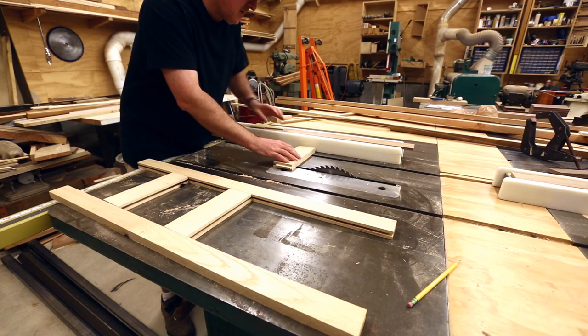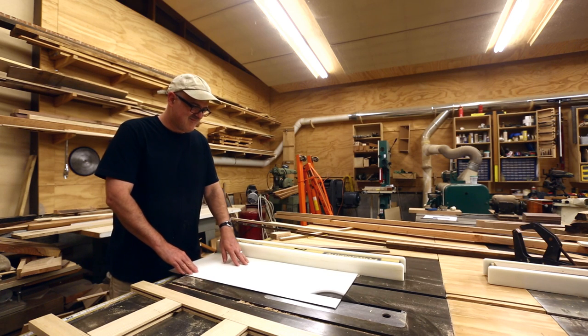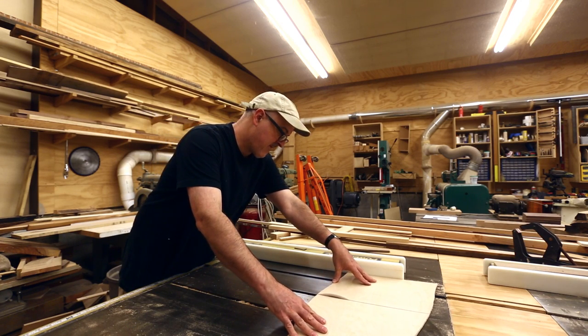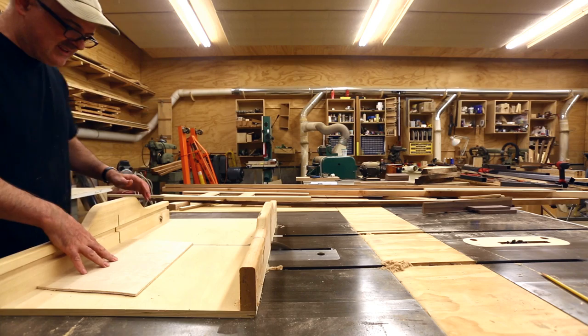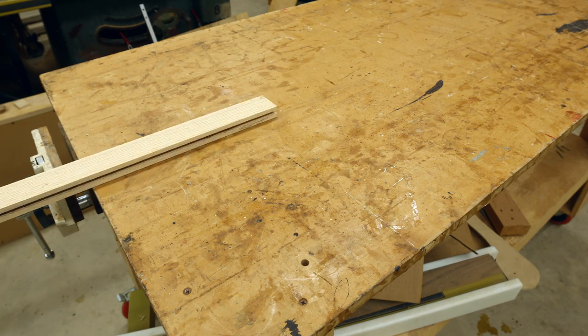For the panels, I can get their width based on the width of the rail — I will make the panels just slightly narrower than the width of the rail. I've got a little scrap piece of marker board I can use for the lower panel. I wasn't quite sure whether to put more marker board down there or a piece of cork, but with the shelf in front of it I figured I'd just do some plywood. This is how the pieces go together.